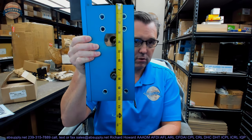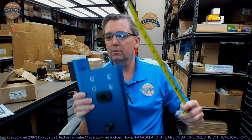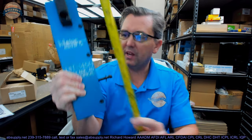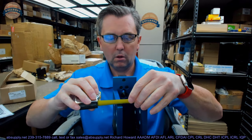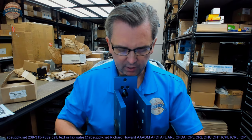Let's take some basic dimensional properties of the item, then we'll talk about what it's used for. The overall height of the face looks like it's about ten and three-eighths or so. The edge of the door, it's about twelve and an eighth inch, something in that range. This is going to be adjustable for different door thicknesses — you're realistically going to be able to get an inch and three-quarter thick door; I don't think it's going to go really any thicker than that.